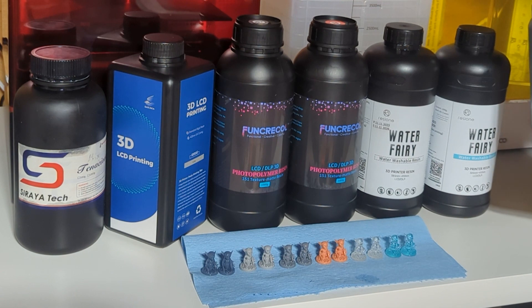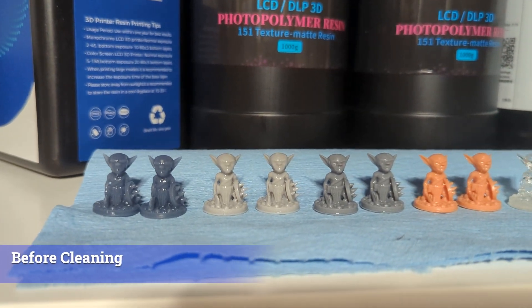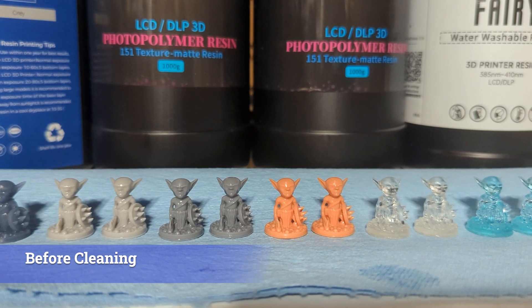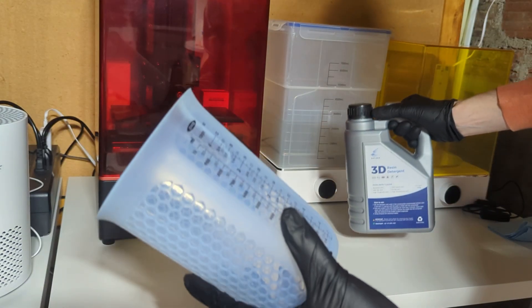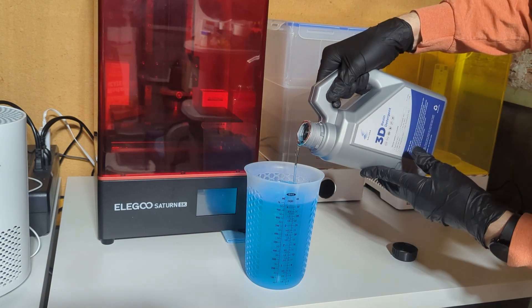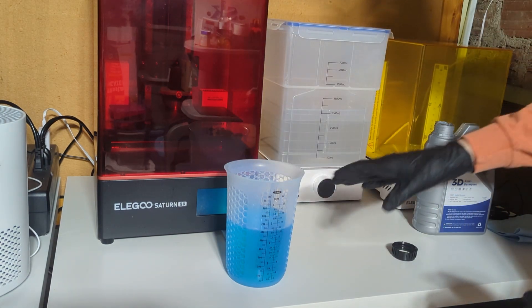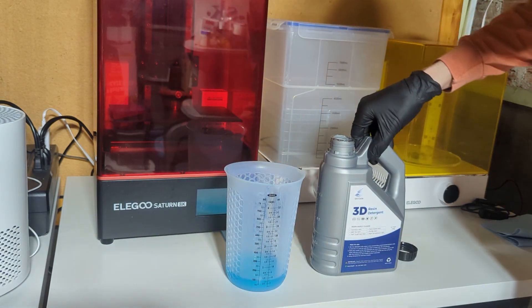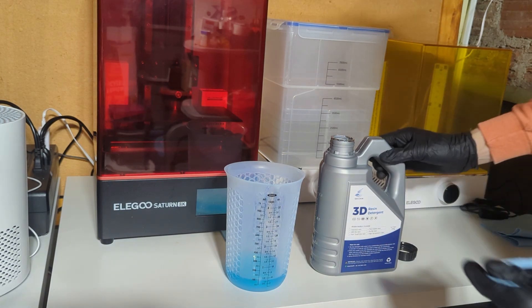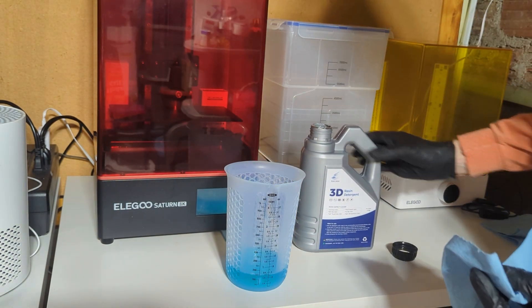With the detergent, same as with Resin Away, you'll want to rinse it off with water afterwards. Let's try and see how much of this there is in milliliters — just over 1600 milliliters. So for a one-to-one ratio you could make about 3000 milliliters of solution, which is as much as I have here. Since I'm using just a small sandwich baggie washing fairly small prints, I really don't need a whole lot, so I'm going to do 150 milliliters of this and another 150 of water for about 300 milliliters total — that should be plenty.